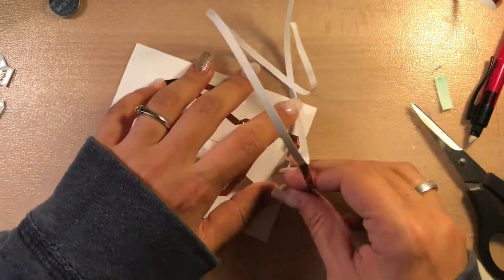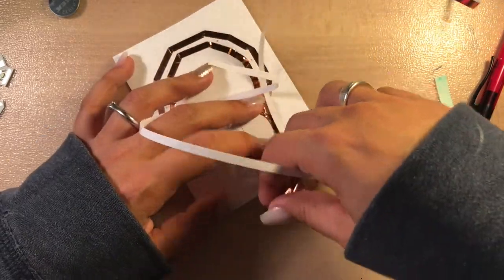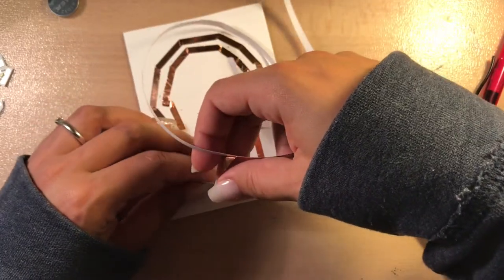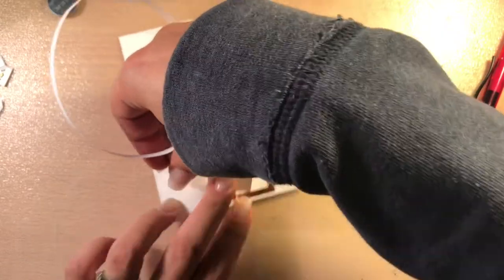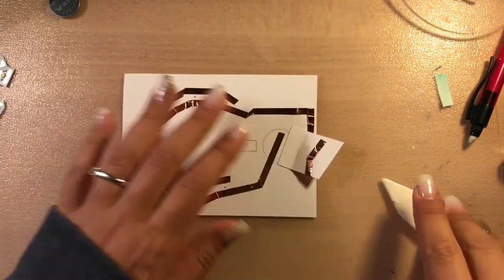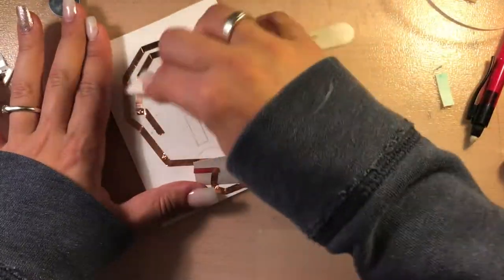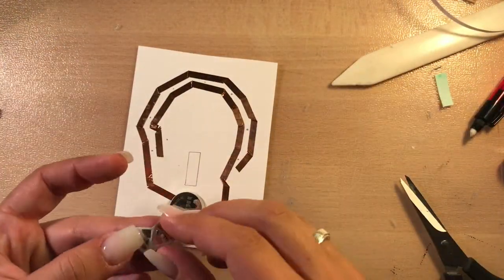The switch is just a simple piece of paper taped down. To get good and smooth circuits you have to bend the copper tape back and forward — bend the tape in the opposite direction than you want and then forward to the direction you want. This helps so the tape won't tear. I use my bone folder to smooth the tape down and press it really well to the paper, which helps you have a good working circuit.